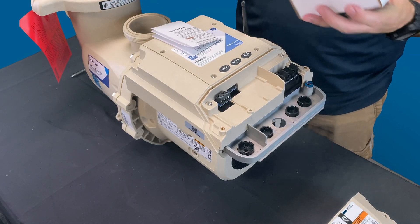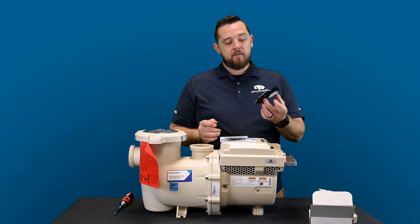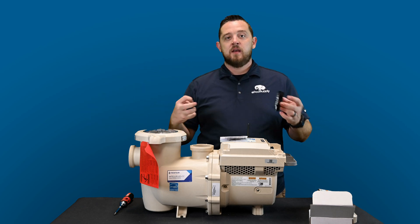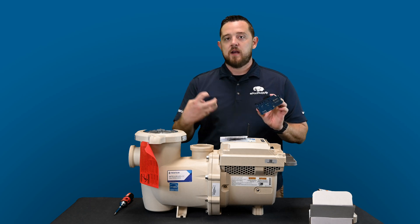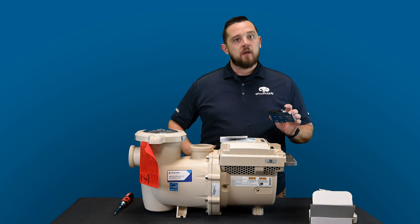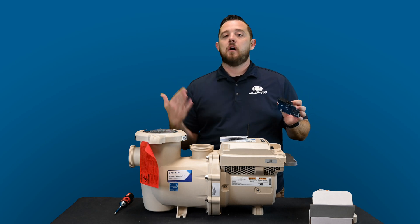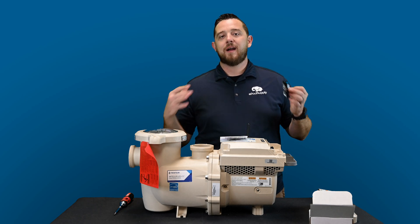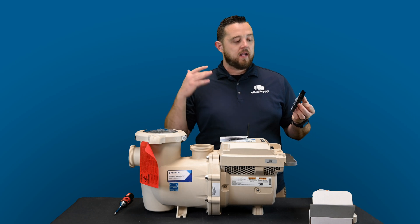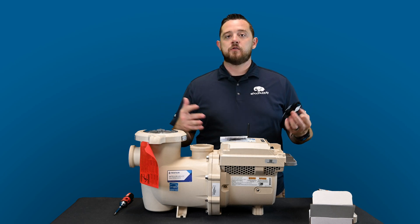The box has little instructions and a bit more information about the I.O. board. I've already taken it out of its anti-static bag — when you get it, it will still be in the bag. Be gentle — this is an actual computer board, so dry hands, make sure you touch something grounded and don't be static. There's a sticker on here with relay contacts and ratings telling you this does not have any sort of GFI. So if you are powering it up, make sure you have a GFI breaker or that your subpanel has a GFI breaker so you don't fry this thing. We sell surge protectors — we'll have those available in the links in the description. When you're spending this much money on this piece of equipment, you'll want to make sure you do it right. If you are unsure how to install it, please contact your pool professional — they will have more information as they are directly trained by Pentair professionals.